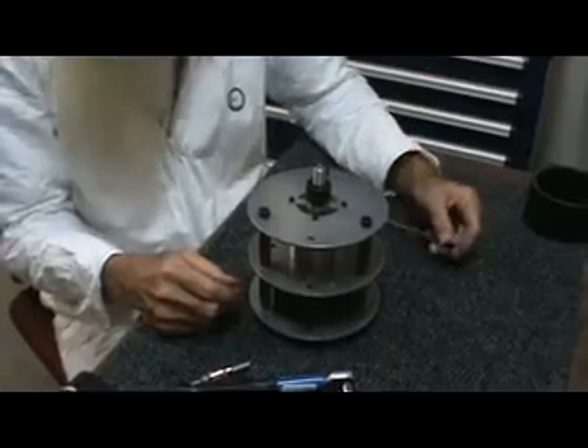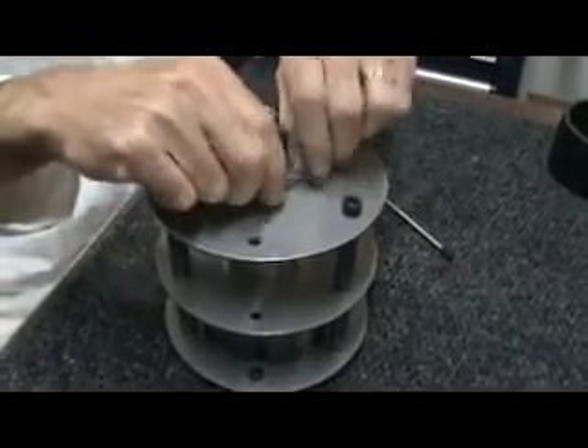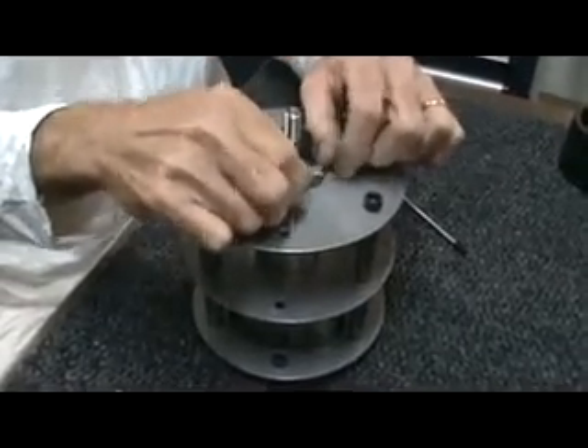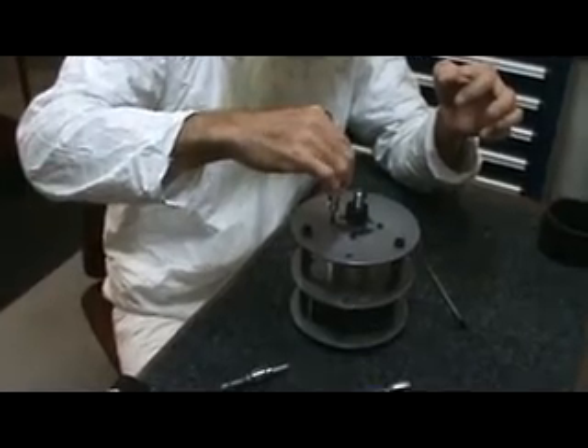Real nice alignment at an eighth of a turn — that's less than you'll use for most espresso grinding. All four of these bolts are loose — that constitutes the tell-tale that I've done this well. On your initial tightening, if one of these is not wiggling, you take it and check if it's binding, because they can bind.